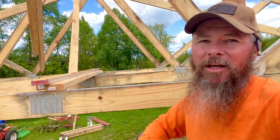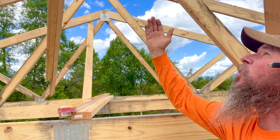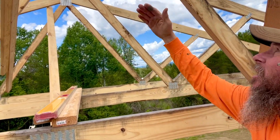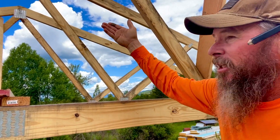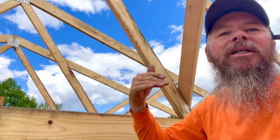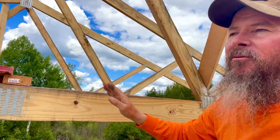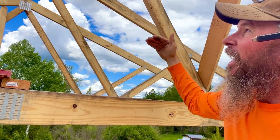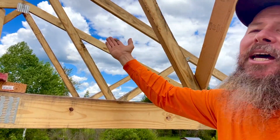Setting trusses is not for the faint of heart. Trusses, as they stand in place, move all over the place — the tops move back and forth. What you see here is just temporary bracing I did overnight so they won't blow down. If you've worked in a high wind area, you learn to put a diagonal on several — you don't have to put it on all of them. Just a couple secures all of them because they're all connected with the purlins. The problem I see is people go ahead and put all the purlins, which ties everything together, but you're presenting more weight. The higher you go with purlins, the more weight on top, and it can domino effect and fall over and take them all down.